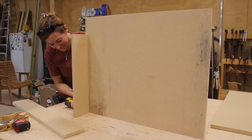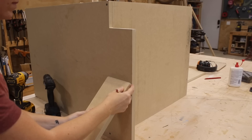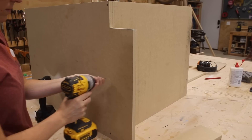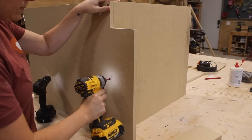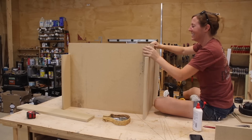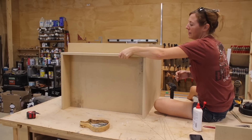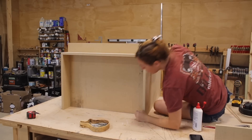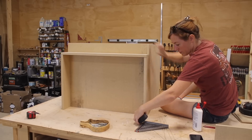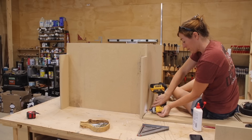I used this trick again when I needed to run in the center hole. As long as the board is flush to the front, it will indicate where the three-quarter inch material starts, which tells you where you can pre-drill your hole. After attaching the first side, I attached the second side the same way. However, since the toe kick now can't fit inside to check for square, I used a tape. I just measured the top, then made sure the bottom dimension matched before driving my screws in to attach.